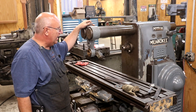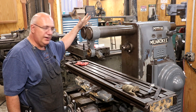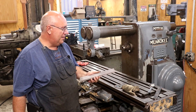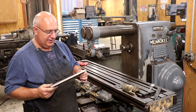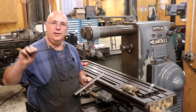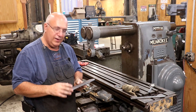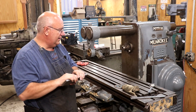I've been using horizontal mills in my shop for many years. I recently sold a slightly smaller version of this same mill — a 2H — and picked up a larger 3H, and haven't had a chance to use it yet. So today I'm making an excuse to use this machine. I've got a piece of cast iron durabar — extruded cast iron — and I have two projects that this is going to be used for. One is I need to make a new gib for my metal planer, about 12 inches long and about one inch wide. And I also need a small piece of cast iron to braze into another part for a viewer job. I can get all the material out of this, but I need to cut it and make it the proper size.